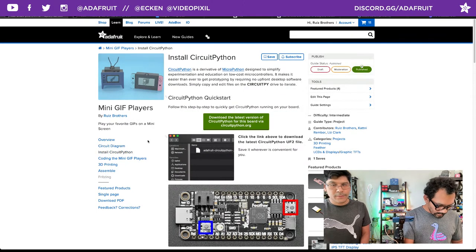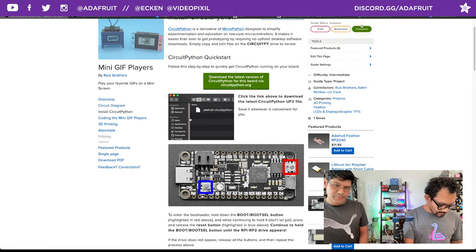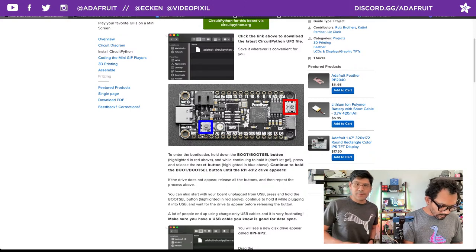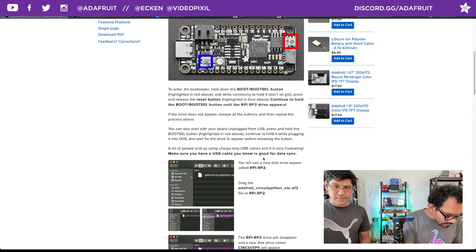All right, so the first thing you want to do with your Feather RP2040 is install CircuitPython. We have a dedicated page on installing CircuitPython. You'll want to click on this green button. You'll go to the CircuitPython site, and then from there you can download the latest build. It's a UF2 file. There are little reset and boot select buttons that you'll have to press in order to get into the bootloader mode. Once it's in the bootloader mode, it shows up like a USB flash drive on your computer, and then you can just drag and drop the UF2.